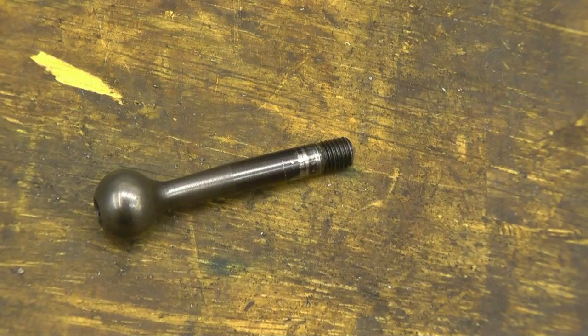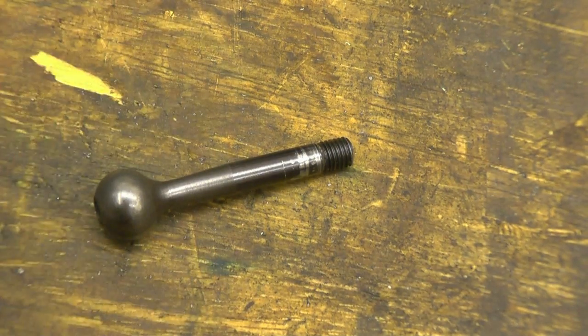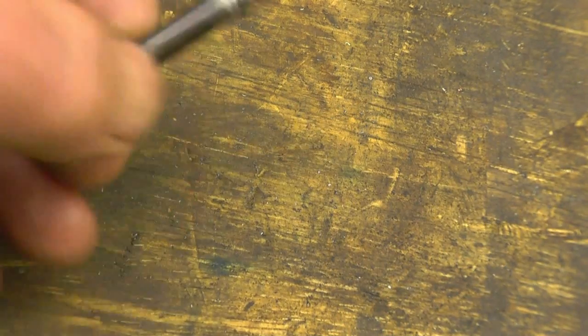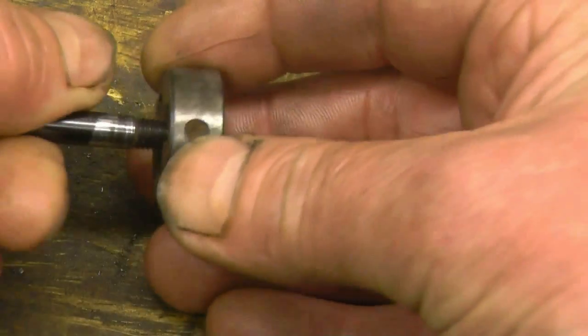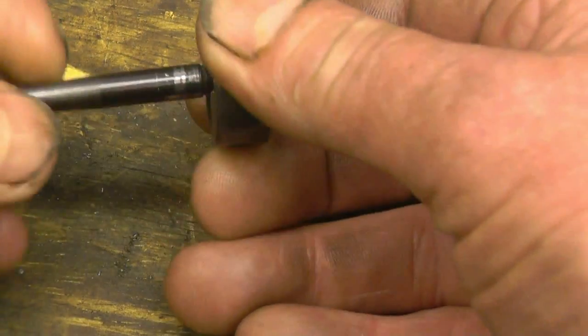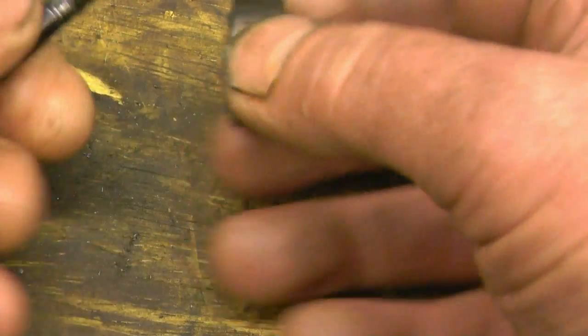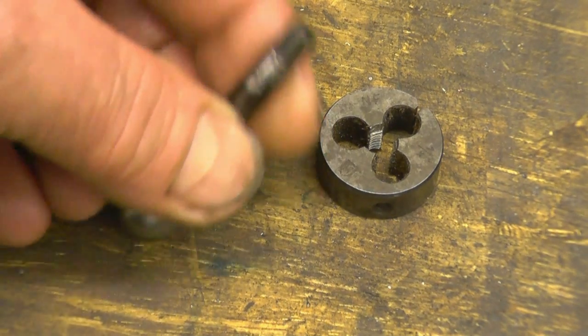So I'd certainly have a go at making one or two different designs for him. I have done quite a lot of air rifle work before. I used to be very keen on shooting air rifles, and I did loads of spring guide tubes for various air rifles. I need to find out what thread that is. I looked at it straight away and recognised the thread. I think it's quarter UNF, and sure enough it is quarter UNF. I served my time in a British Leyland garage, and quarter UNF was a really popular thread, miserable as it may be.